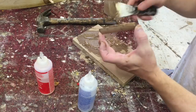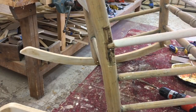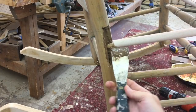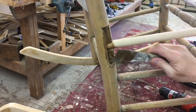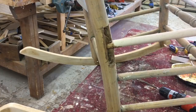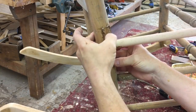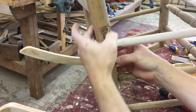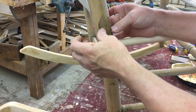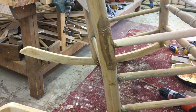Now we'll butter up our little patch and fill in the cutout area as well. Make sure we get plenty in there. Adding the sawdust really thickens up the epoxy so it doesn't run and it will help to fill in those saw cuts. It will act like a wood filler. I can feel it starting to set up already — the epoxy is heating up. We'll just let that sit for a few minutes and then start filing it down.